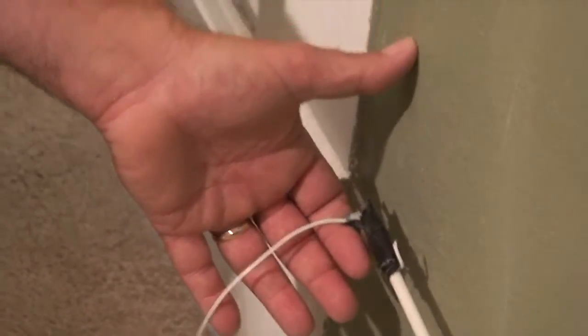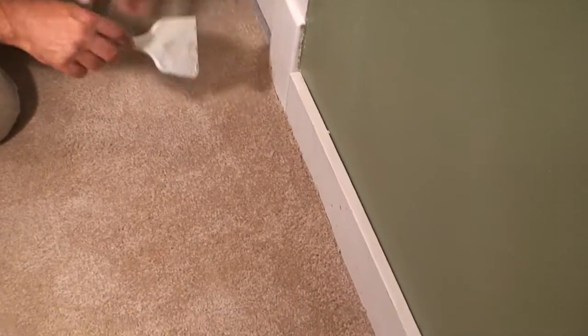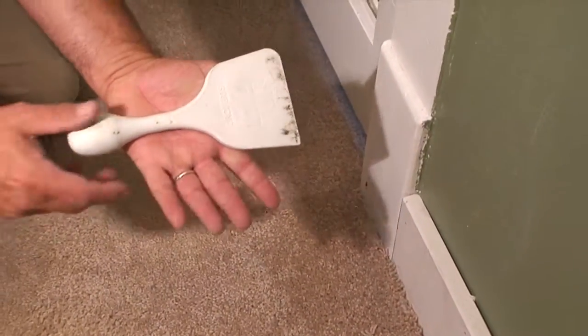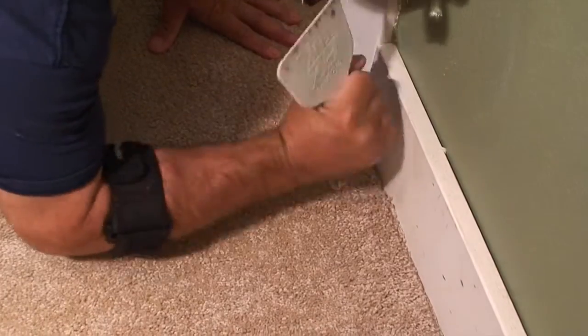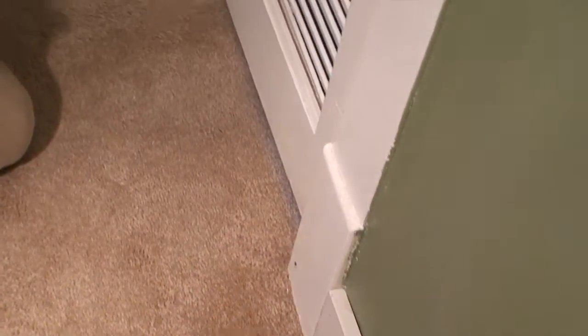In commercial carpeting where we're going to deal with glued-down carpet, it's a different process — we'll talk about that later. We simply need to get the carpet reattached to the tack strip. This tool is called a carpet tucking tool. It costs about seven dollars at Lowe's or Home Depot — it's absolutely perfect. We'll get a nice push here against the wall and tuck it in between the two. It's perfectly connected and a hundred percent invisible.